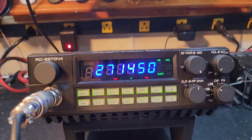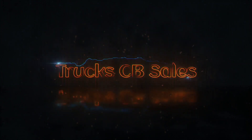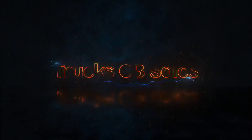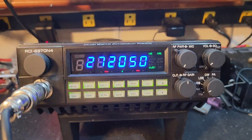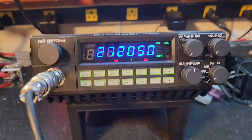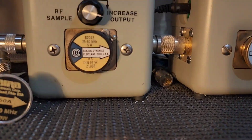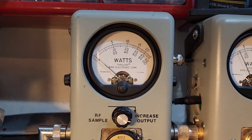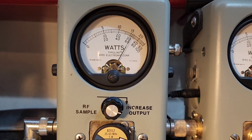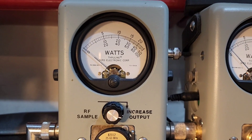All right Justin, we're gonna get in here and do some work. We're back — we got you ready to go: tune alignment, voltage regulator upgrade, amp on/off switch on the back. With the amp off and a 5-watt slug, just a hair under a watt. Roll it up — 3.5 watts, so you're in no danger of smoking your amplifier.